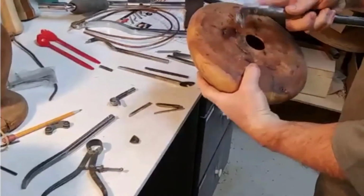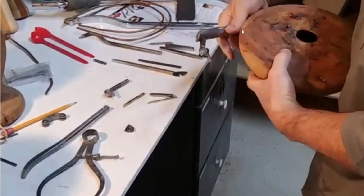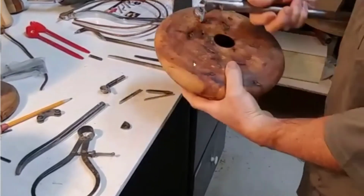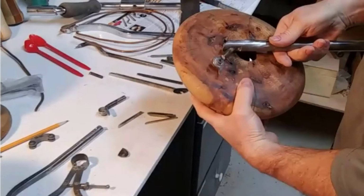And in fact, I did achieve getting out to the farthest parts of the diameter with this arrangement. Now look at this piece here and you can see that you're hanging over. I was talking about inducing torque, okay? So you're way over, this distance is maybe 2 or 3 inches off of the center axis. So the torque is significant.